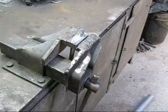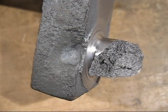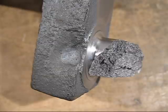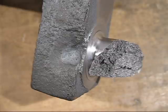That did the job. It broke. Here is the aftermath of what happened when I twisted that crank pin with the Stilsons. It let go. But what was very interesting, I highly recommend going back to the previous clip and having a very close look to see how far that crank pin twists before it breaks. It was very surprising to me. I would have thought it would have broken straight away. But this test is for tension. Cast iron has its weakest point in tension, not under compression.